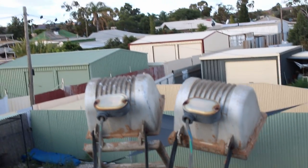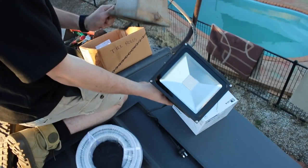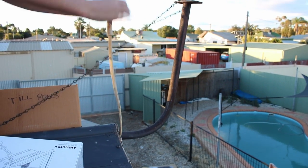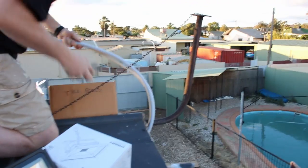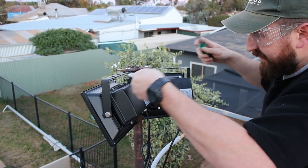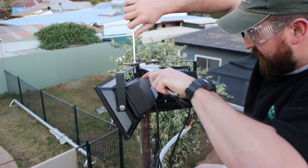The insulation was pretty much rotted away and I had to use an angle grinder to cut the bolts because they were so rusted. Here's the old versus new. I removed the old junction box and the cracked conduit from the mains cable. I'm not going to show too much of the electrical process because if you don't know what you're doing you can get seriously injured. I have my restricted electrical license so I'm qualified to replace those lights, and I'm confident the circuit is fully isolated. I used some 8mm bolts with nylocks and mounted those lights underneath the J pole — on hindsight I probably could have painted that pole, but never mind.